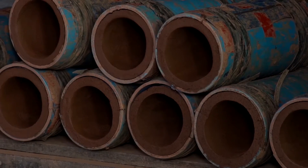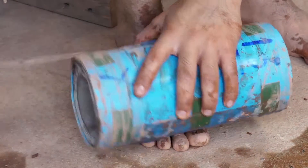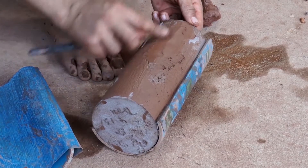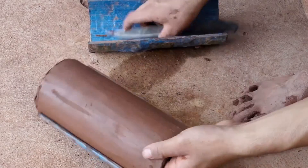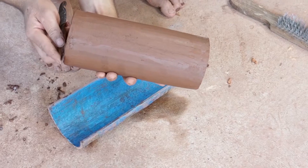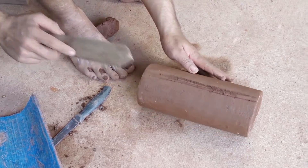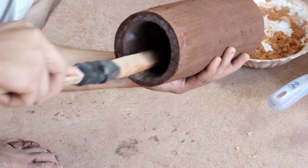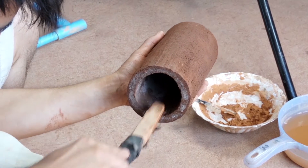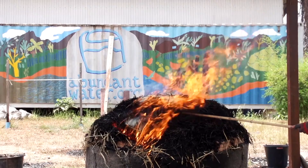This stage of your filter is complete. It will need to dry for three days on a rack. The clay filters have been drying for three days and will hold their shape. Now we remove them from their plastic molds and begin to smooth the outside with a knife. Next we trim the excess clay from the filter and use the roll test to ensure that each filter is properly molded. Next, we use wire brushes to scrape the inside and outsides of our filters — this is going to increase our surface area and allow more water to pass through. Next we'll rack dry the filters for two or three more days, then sun dry them another three days. Once the filters are dried, it's time to move on to the next step: firing in the kiln.